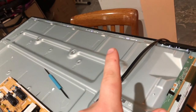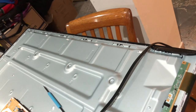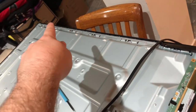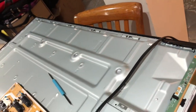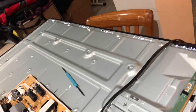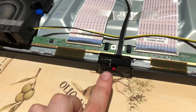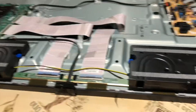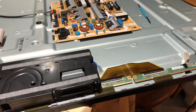The backlights are on and then they went off — they dimmed and then go completely dark. You can see the holes there. The TV is turning on and then turning off, and the red standby light is blinking twice — same issue as the other two. We're going to get right into it and fix this one for the customer. Ribbon cable time.